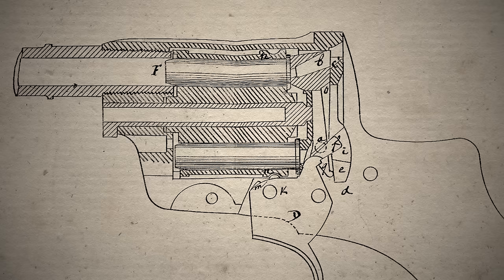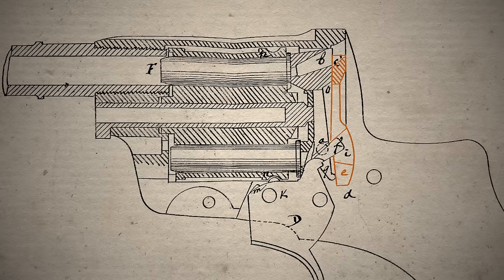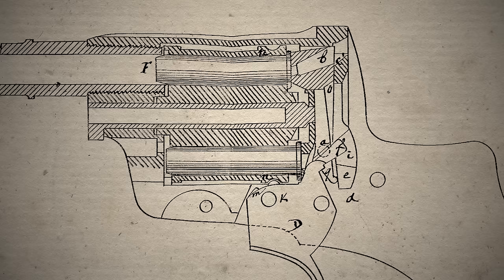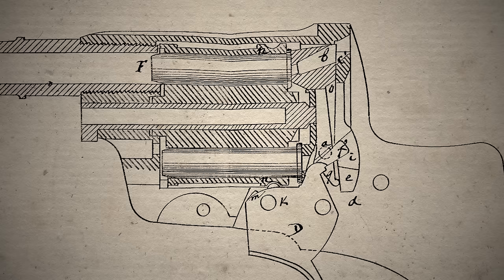This is accomplished by pressure from the hand and a supporting tilting breech block, not unlike the original 1877 patent, though now it's supported by a vertically sliding block, which we'll see better later, along with how the cylinder is indexed forward. The return method at this time seems to be by using the cylinder stop and its matching slots in the cylinder wall. The cylinder and gate now also interact. Thanks to the constant tension rearward on the cylinder, notches have been set at the cylinder's rear facing edge, which meet a stud on the front of the gate. These will detent into each of the loading positions.